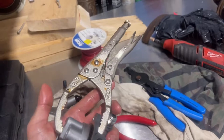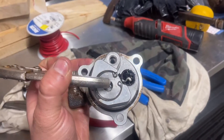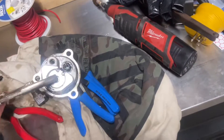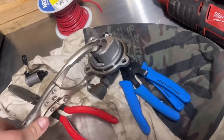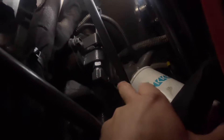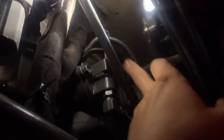Outside circlips in — they can rotate but face that upwards. I use these vice-grip oil-filter-style pliers my dad found somewhere — I use them to squeeze this down and get the circlip in, because those two washers hold tension. Make sure your circlip's seated in there, pop the tension off, and you're ready to install this back in the tractor. Tighten up your flare fitting there. I forgot to mention there is a bracket on here just to hold your wiring — put that back on. There's no torque spec for these; it's just an O-ring in there, so a good snug with a quarter-inch ratchet is fine, or a decent snug with a three-eighths.